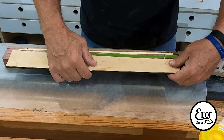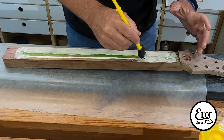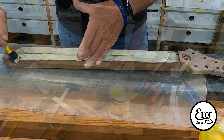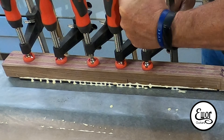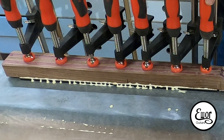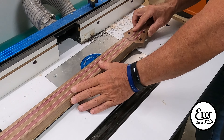Now you can watch me put way too much glue on this fretboard — as it turns out, the glue was dripping all down the thing. Luckily I can run it through the router and get rid of all that excess glue, and then I've got to radius the top which will clean up any mess too. Once it's set up — remember it hadn't been radiused yet — I could ride it on the perfectly flat fretboard and run it down my router table with the flush trim bit to trim up the edges really nicely. Next time I'll use the CNC for all of this including cutting that out, but as I'm learning, this is the way I decided to do it. It's ready to get radiused and get some frets in.